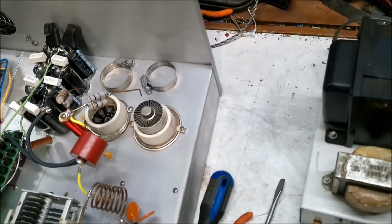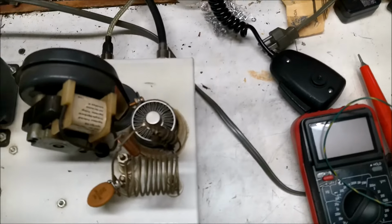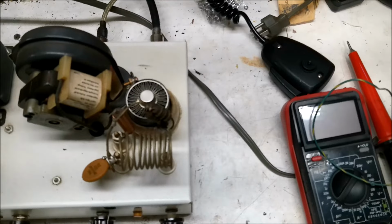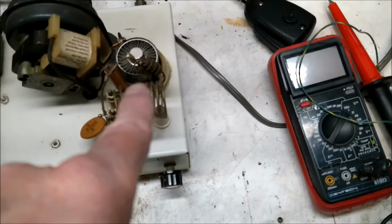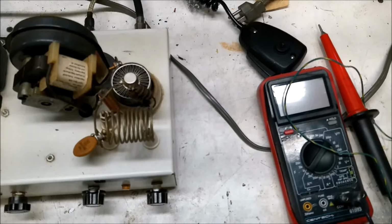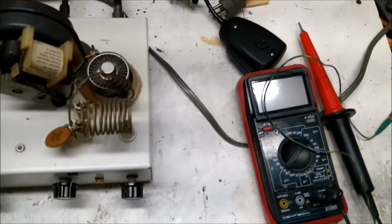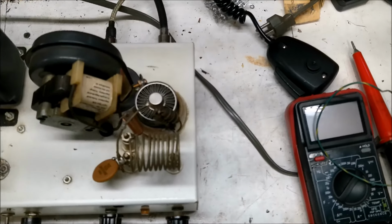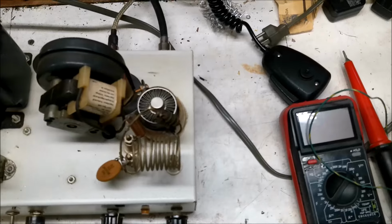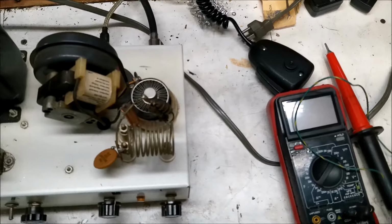Okay. So we're retesting both the tubes, making sure one of them didn't have a flashover. So that's what we're testing it with. The high voltage going to that is 1,750 volts. So, okay, some of you say, oh, that should put out more than 525. Yes, it could, but the plate voltage is low. So we only get 5 1/4.